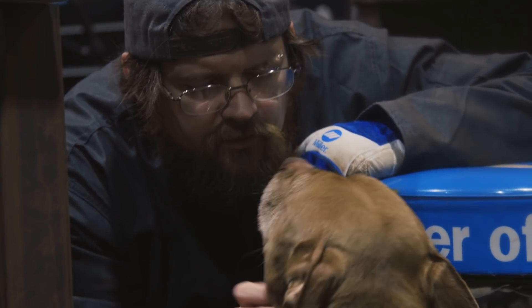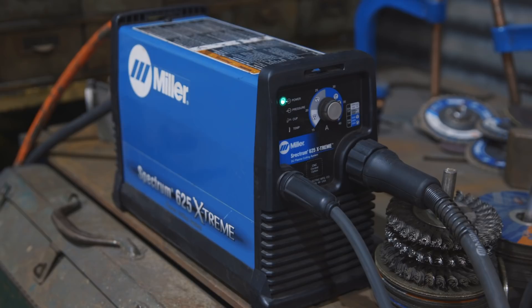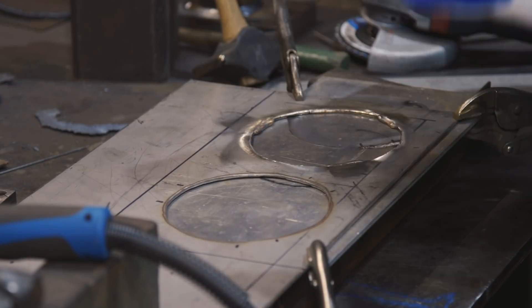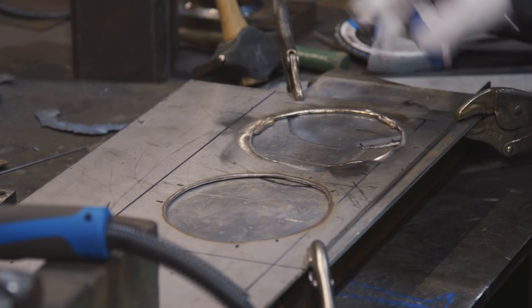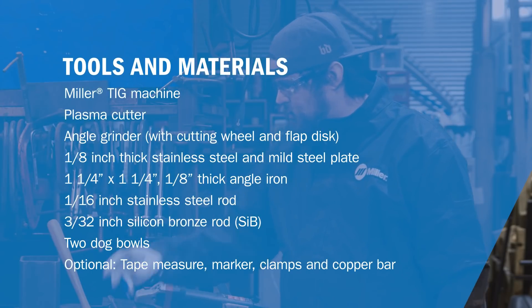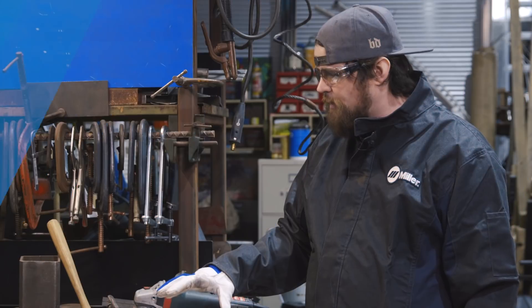Currently I'm sort of in the middle of it. I've taken my Spectrum 625 Extreme Plasma Cutter and chopped out circles in the middle of it for the glass dishes to sit in. Right now I'm going to be cutting the outside profile of the top and then we'll be adding some sides made out of mild steel and using silicon bronze to put them together.